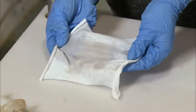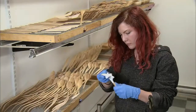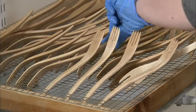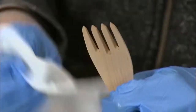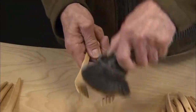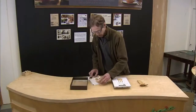The final step is an intricate hand-applied finishing process: three coats of a proprietary mixture of food-safe plant oils, waxes, and lemon. Lemon works like a solvent, diluting the mixture so that it penetrates deep into the pores of the wood. After the last coat dries, a worker manually polishes the surface with an ultra-fine abrasive pad. Sweep off any dust, then let the finish cure for 28 days.